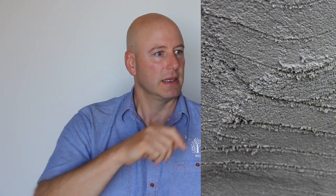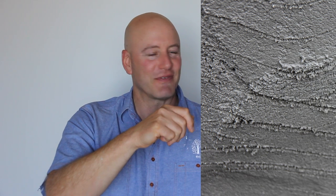This is a close-up on the scratch render. Now that Mark starts applying the first coat of render, he uses what looks like the biggest afro comb you've seen in your life and just goes along doing a scratch coat — so that when he applies the next coat of render, it adheres a lot better because it's got these little scratch marks and indentations to adhere to. You can see the scratch render — he's applied the lime render on top of the cement render.